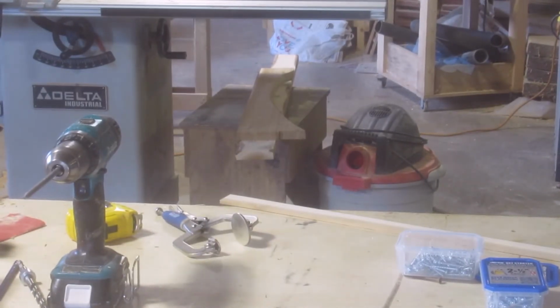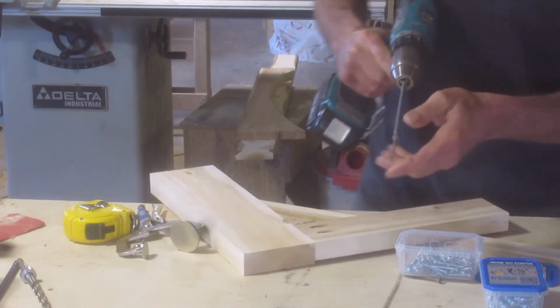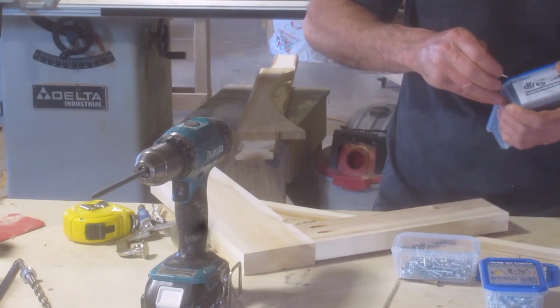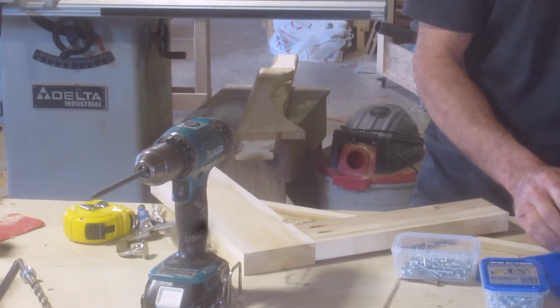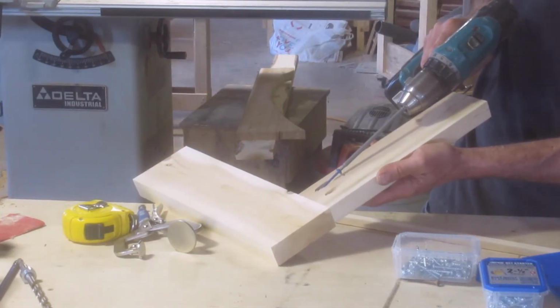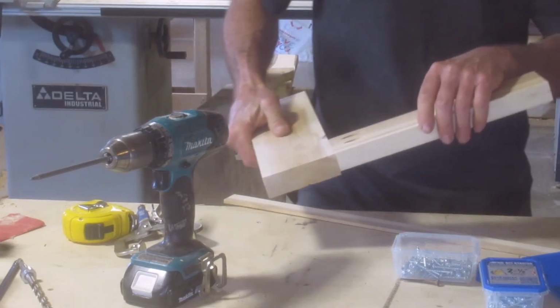The deck screw is a 2-inch, and I'm going to remove the deck screw, and I'm going to try this outdoor 2 1/2 one from Kreg. And it is fairly longer. This one might poke through. And oh, it did not poke through. See that? It didn't poke through. So that, get it in the frame, it never poked through. The 2.5 is on the top, it's blue.